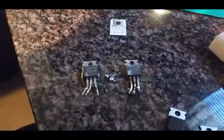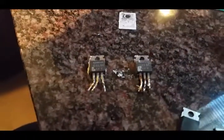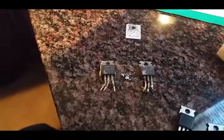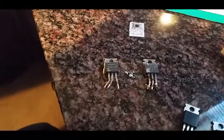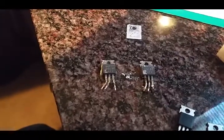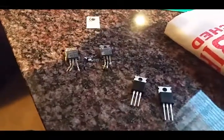So the transistors are right here. As I suspected, one of them is faulty — the one on the left. The center pin does not conduct in either direction. So if your meter is on the diode testing setting, it should only conduct in one direction, but that one is open no matter what. We'll put the meter to it and show you what that looks like compared to our new ones. We also have our insulators here and we're going to apply some new dielectric grease so these can transfer heat and don't burn up.